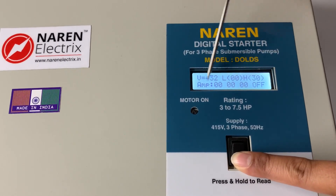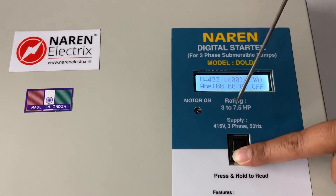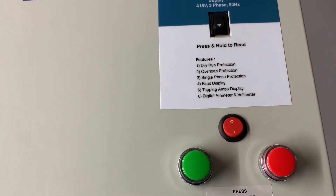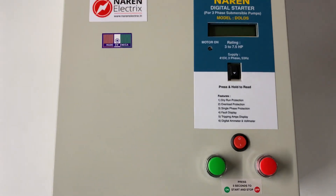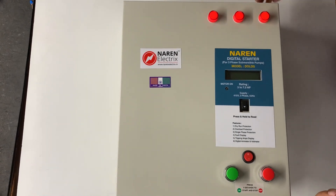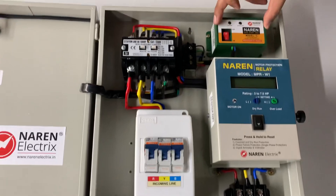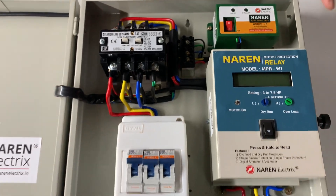It has a 3-Phase Ammeter Display on the second line and a Motor Status indicator showing whether the motor is on or off, with an LED indicating motor condition. There is also a switch to turn on the Auto Start Unit. Auto Start Units are widely used in the agricultural sector — the purpose is to switch on the motor as soon as the 3-Phase Supply is resumed. Whenever the 3-Phase Supply is back, the Auto Start Unit inside makes sure the motor starts automatically.